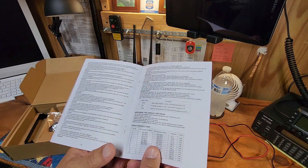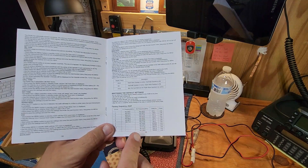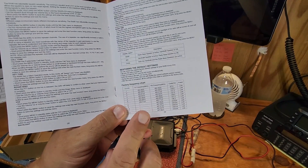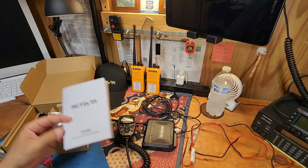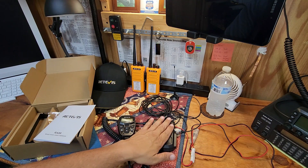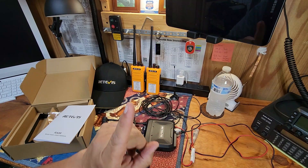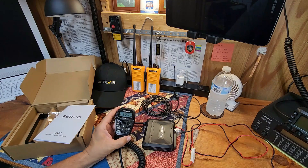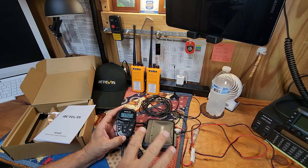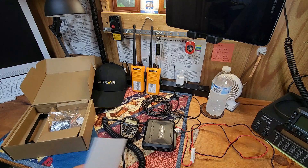The other downside to this radio — and you'll see when I do the power test — is that you cannot transmit on this radio on any of the FRS frequencies. I think it has to do with them not being able to get the power low enough, because I think you're restricted to half a watt on FRS. Well, low on this is 5 watts and high power is 20 — but as you'll see, you aren't getting 20. That just drives me nuts, especially for a GMRS-specific radio. There's no reason you shouldn't be able to dial it in to what you're advertising.